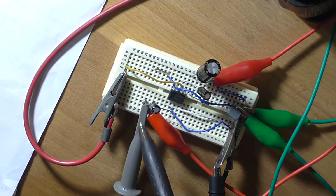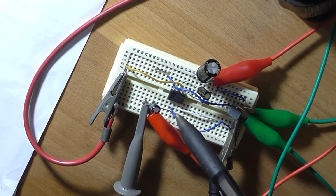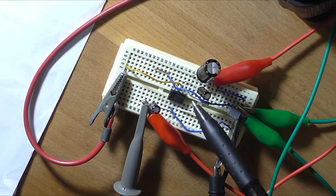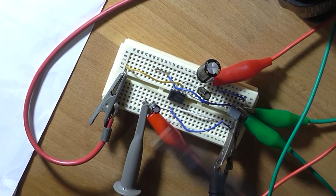And I've got an oscilloscope probe measuring what the input voltage is to the amplifier, because there's a pot off screen, a 10 kilo ohm pot, as a volume control, just so I can control where it gets to clipping and back it off, etc., and measure what the actual input sensitivity is at that output and that voltage DC setting. I've also got a dummy load off screen here too, with a second channel of the oscilloscope measuring its output. And currently we're set to 8 ohms.